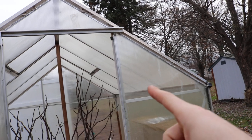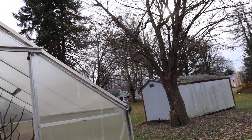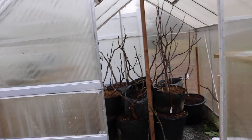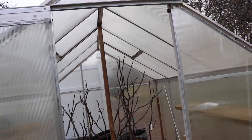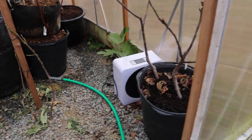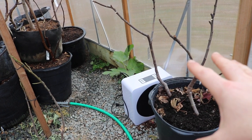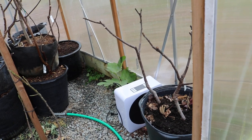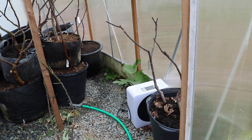Insulating with the tarp really goes a long way even if you're blocking out the sunlight. The sunlight only heats things up on very sunny days, and that heat escapes very quickly once it gets dark. The plastic alone only provides about 3 degrees of insulation — so if it's 0 degrees outside, it's only 3 to 5 degrees in here, which is nowhere near enough. With the tarp on, I'm gaining about 10 degrees. Then the heater gets kicked on to keep things above 20 degrees — and 20 gives you a little wiggle room in case you lose power or something unexpected happens.